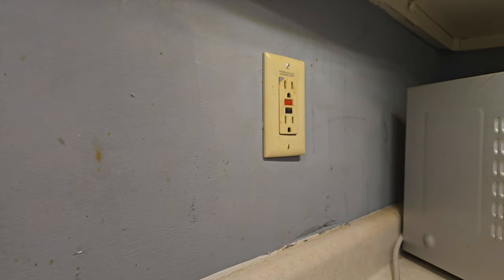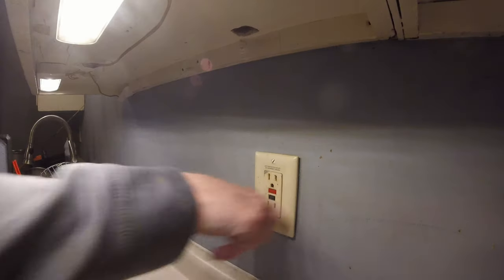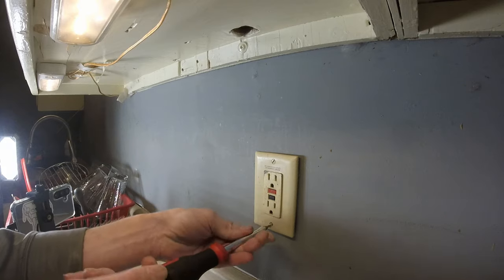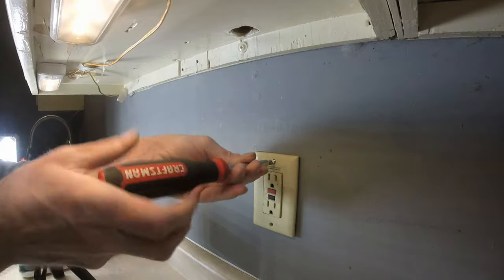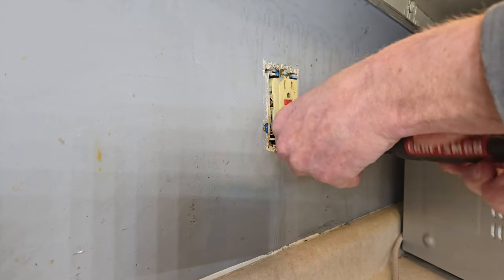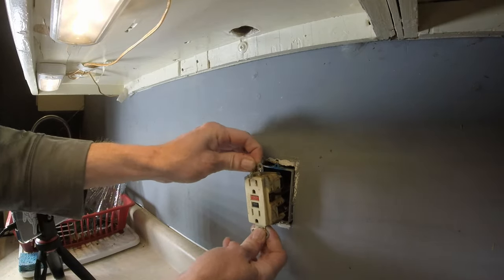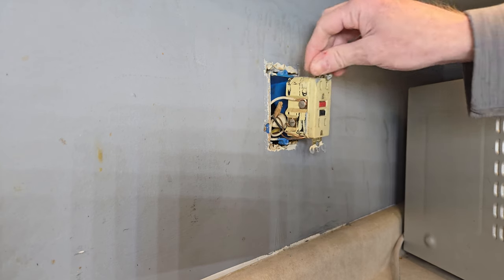Always double and triple check — use different meters. I've brought a work light to make things easier to see. We're not reusing this plate or these screws. I have electrician screwdrivers but we're not working on a live circuit. I noticed this is in a plastic box, so it couldn't have shorted against the box. Now triple-checking, I hope there's enough wire in here.